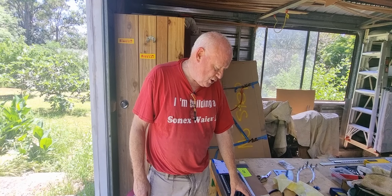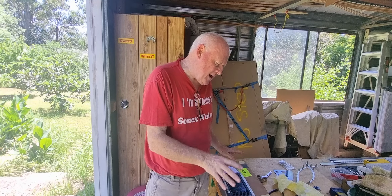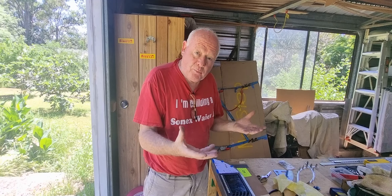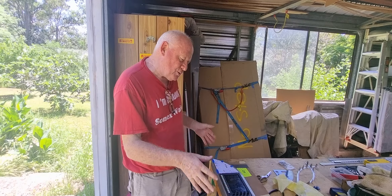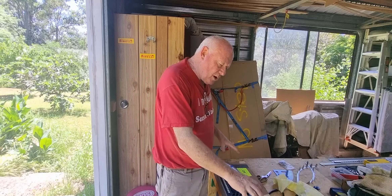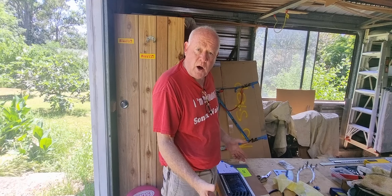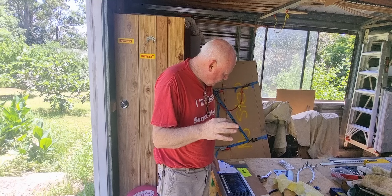Welcome back. I've decided to finalize the instrument panel cutouts into the actual aluminium part of the panel itself. I've just laid down two white pieces of scale-drawn side pieces - what I'm going to call the parts of the instrument panel that are going to be made from a place in Melbourne. You may remember a couple of videos back I spoke about having these made up, so I've just taped them in position. I'm going to transfer the centerline holes to drill through the backs of the panel. When the new panels go on, I simply lay it over the top, work out how I'm going to fix them in spot - yet to be decided. I'll just do a zoom in so you can see the wording of everything and how it's going to go.